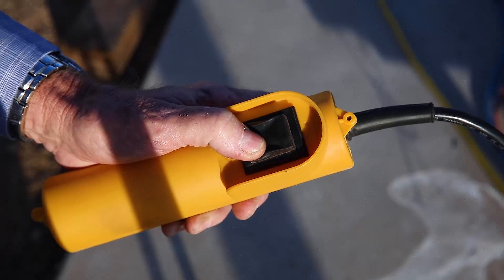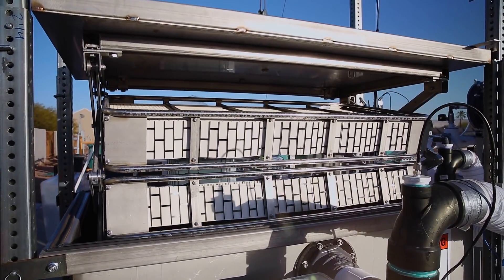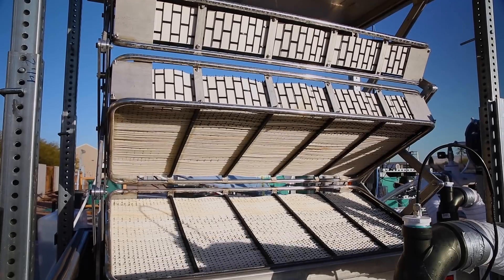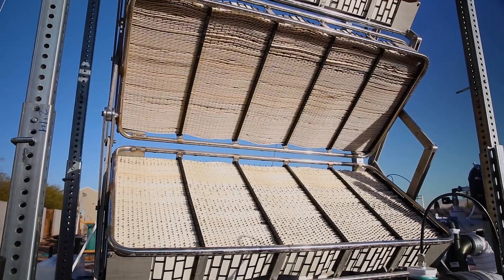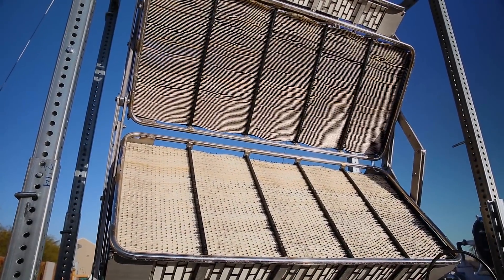It contains the sails that actually do the contacting with the air for the capture of carbon dioxide. The three panels behind me are made up of white leaves — that's the material we use to do the air capture of the CO2. It's an anionic exchange membrane and it has a strong affinity for carbon dioxide when it's dry.